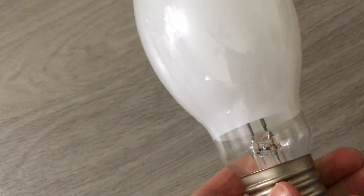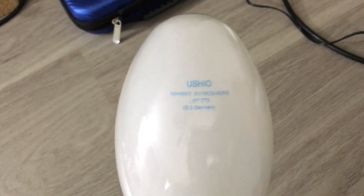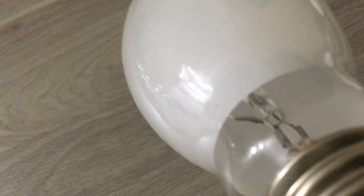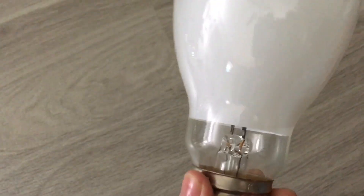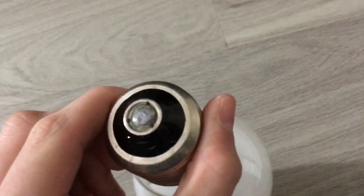Let me give you some specifications about the lamp, and then I'll turn it on. This particular Pulse Start Metal Halide bulb produces 40,000 lumens, and it's the brightest bulb out of all the 400-watt metal halide bulbs I have — the Philips 400-watt metal halide I reviewed over a month ago was beaten by this one. This bulb has a color temperature of 4,200K, or cool white, almost like cool white fluorescent. The coating on this bulb is actually not phosphor — it's just a normal white coating. And this bulb has an average life of 20,000 hours.